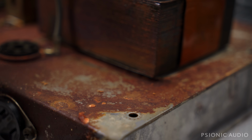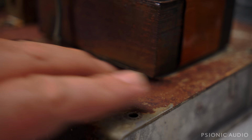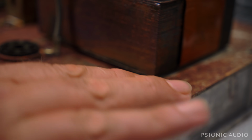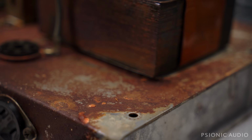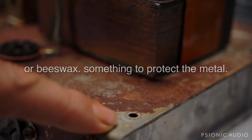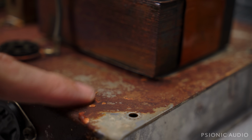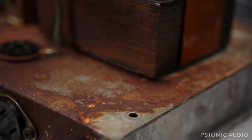What I would do is take everything off the chassis, pretty much. I have to. At which point, the outside of the chassis I would do with WD-40 and 1500 grit followed by 2000 grit wet/dry sandpaper, which really gets the rust out and leaves a very smooth surface. And then maybe a light shellacking just to keep it from rusting again. This metal chassis used to have a coating on the outside, and it's gone away. But I'm getting ahead of myself.